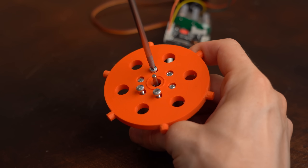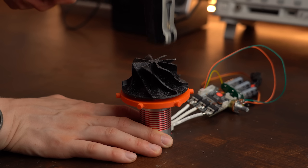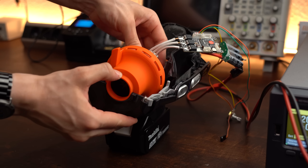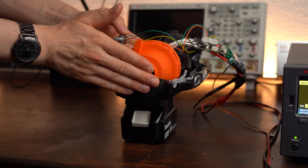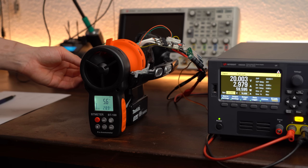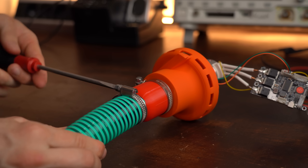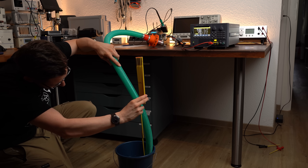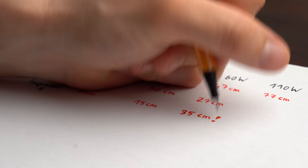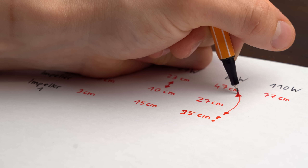Let's attach the motor to the also newly designed motor mount that locks into the top piece very firmly, hammer on impeller No.1, put everything together and go for a spin. This thing spun beautifully and reached a new airflow high score of around 6.7 m/s at not even full power. Moving on to the pressure tests, this system performed way better than my design and reached a distance of 35 cm at 60W, which is still around 10 cm lower than the original motor.